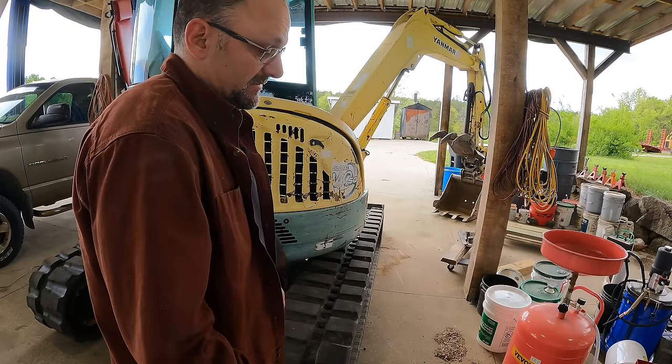Here's our new adapter. And then here's hydraulic gauge number two. So the 10,000 PSI gauge is on the right. The 6,000 is on the left. Okay, now quick reminder of what I'm doing here. When I push forward, I am directly pressurizing straight off the control valves into these test hoses and straight into the gauge, and it's a dead end.